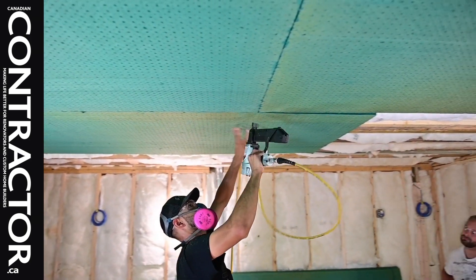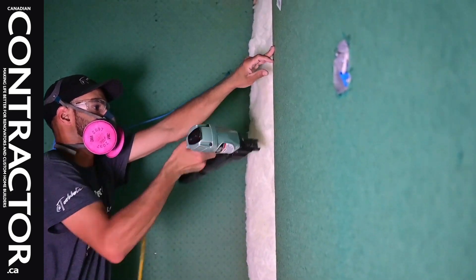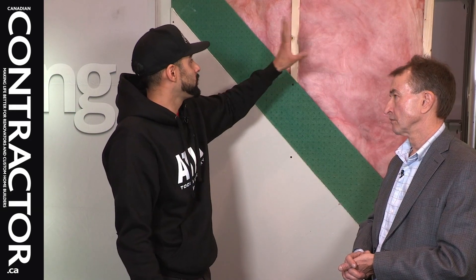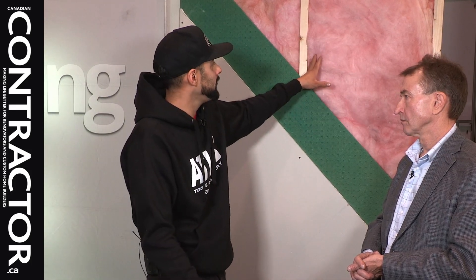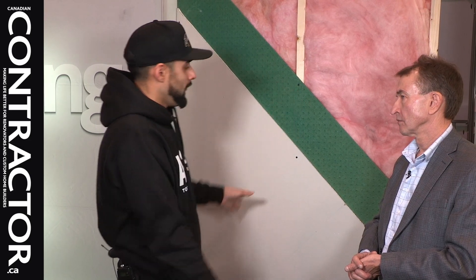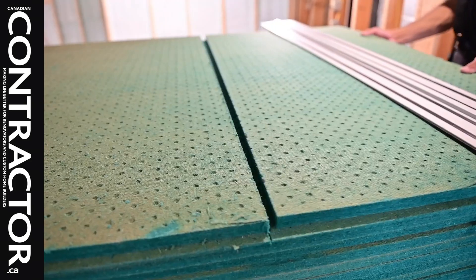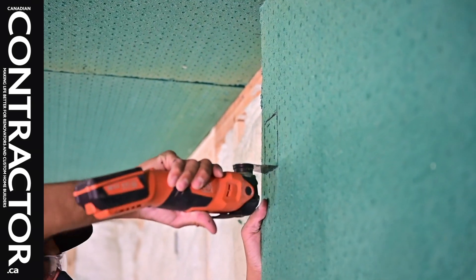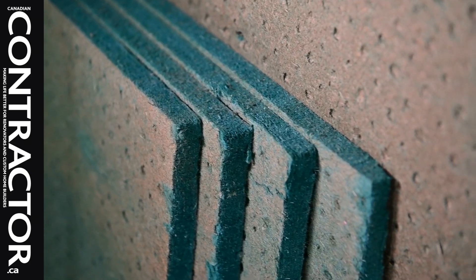Because it's in sheet form, it's faster to install. They do recommend that you add either fiberglass or rockwool insulation into the stud cavity to help with resonance in the stud bays. Apart from that, you board as normal, cutting those boards to fit. We cut with a track saw and made our notches with a multi-tool.